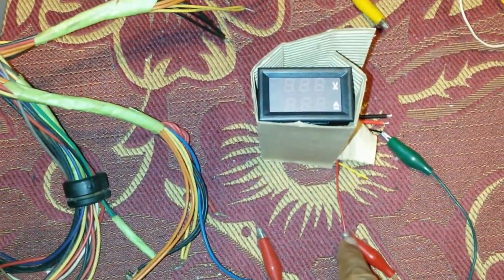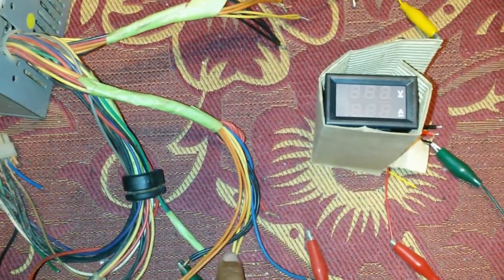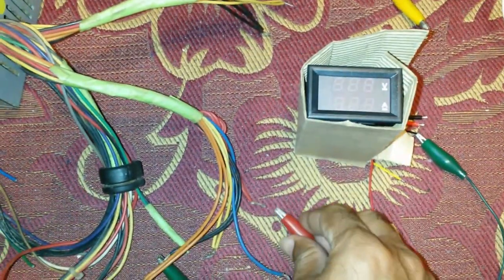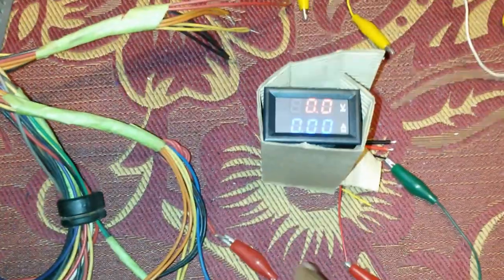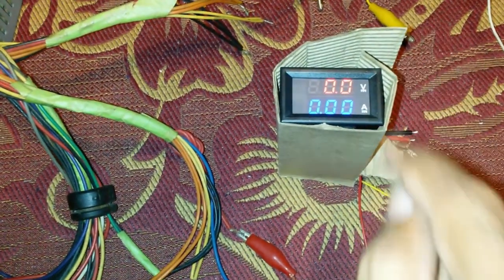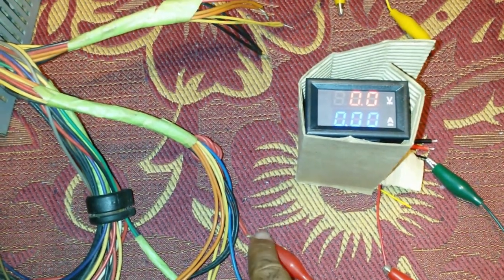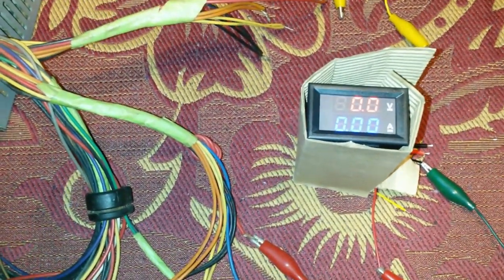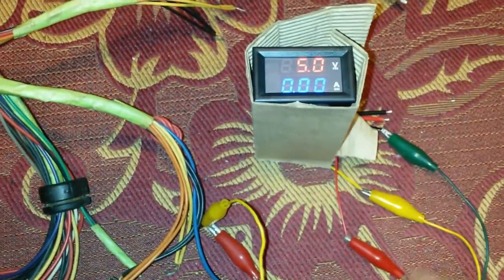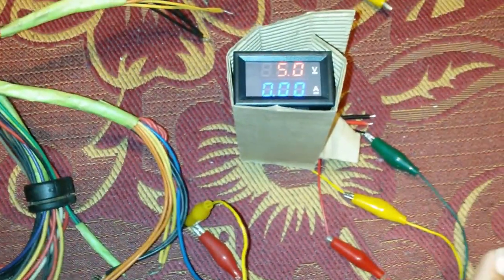So what I've done is connect positive and negative to the power supply, and this is red, positive 5 volts. And I expect that when you put this on, it'll come on, which it does. Alright, that's to be expected. There's 0 volts, nothing measuring, no current. What I'm going to do now is jumper here to our positive, and we should see our 5 volts. Expected, when we jump up, we get our 5 volts. So that's our voltage source as we expected, as was predicted.